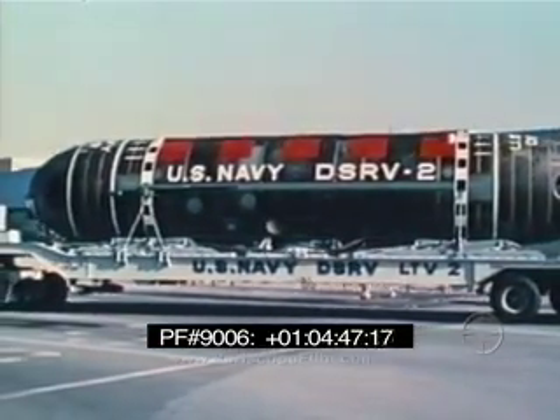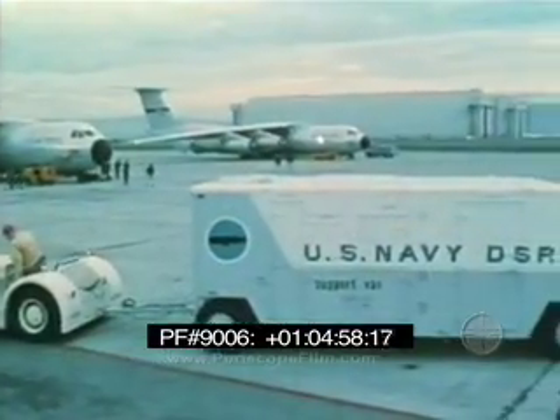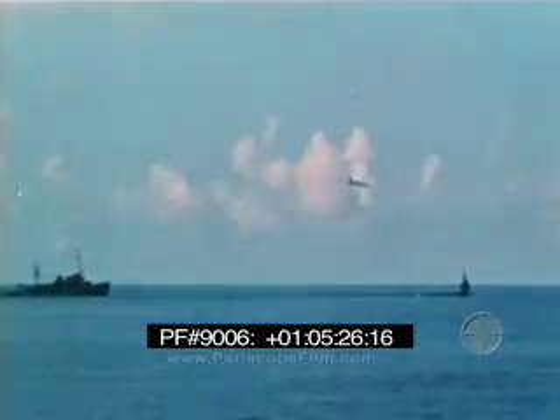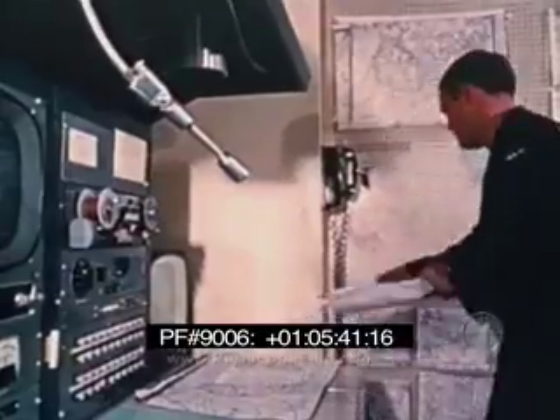The DSRV is about 50 feet long, 8 feet in diameter, and weighs 35 tons. One C-141 carries the DSRV. Two more C-141s carry the support band, skirt, and mother sub pylons, auxiliary equipment, and the DSRV crew. At the remote port, a United States representative makes arrangements to receive the rescue vehicle and its support equipment, and move them from the airfield to the port, taking care of all customs and logistics problems with the help of local officials. Of course, the people first on the scene are still working too — they're vital members of the rescue effort. They're sending back information on subsurface topography and temperature profiles, wind and sea conditions, currents, existing weather, and the long-range forecast.